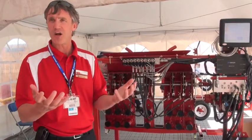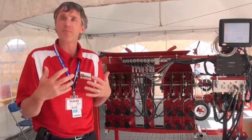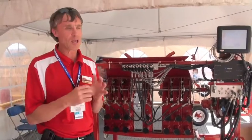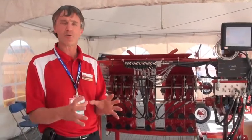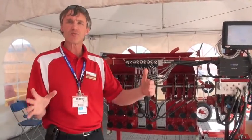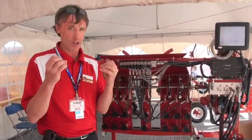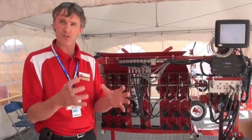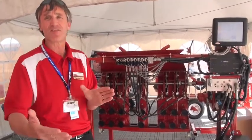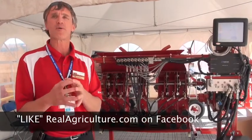Conversely, if you want to open up your slides because you're not overlapping, you have to time the monitor to open that slide in time to fill that meter roller and get it seeding at the right time. We just weren't comfortable with that. We had two prototypes running in the field this year with two cooperators on a slide system — a nine-run system with nine slides. Technologically there was a lot involved: a lot of hydraulic lines and hydraulic rams for those nine slides, and that's per tank. With four tanks, you've got 36 of them to control. We just weren't comfortable with the shortcomings of the slide system.